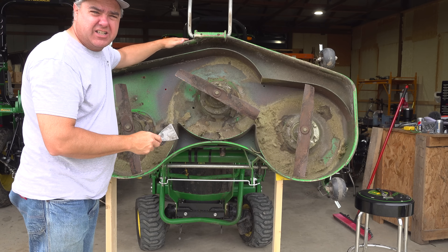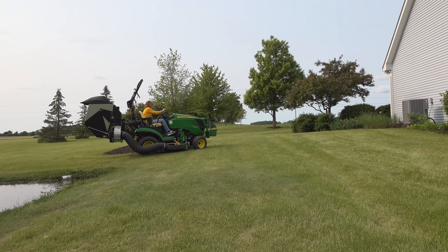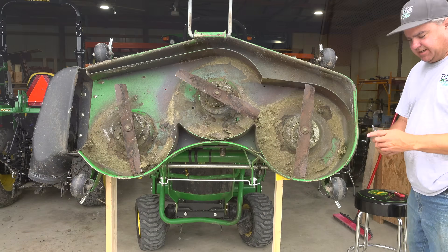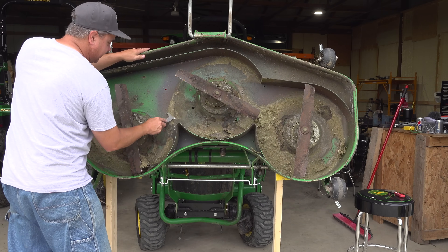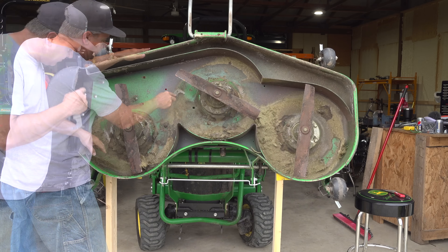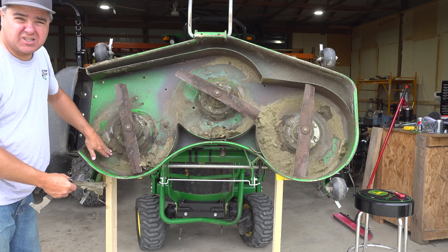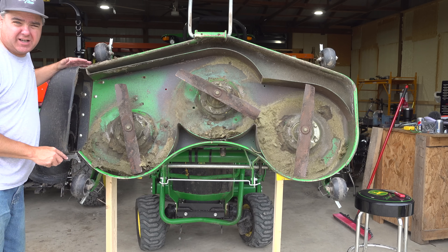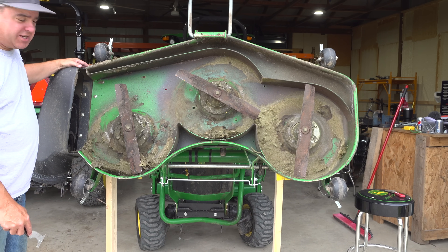It's really not very bad considering how wet the grass has been. I wonder if that TKV-20 actually pulling a vacuum on this actually keeps it from gumming up as bad. I've got a little thicker scraper here I think I may try. It's not quite as sharp. Over the long term, this stuff sitting against your deck will cause it to rust and corrode, so we need to get it out of there. If you've got time, do it after every mowing. If you don't have time, well do it when you can.